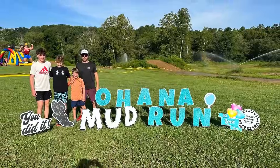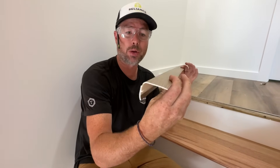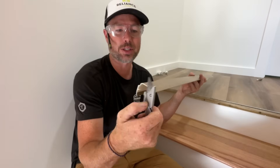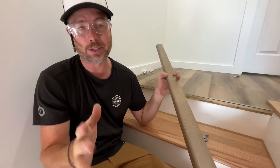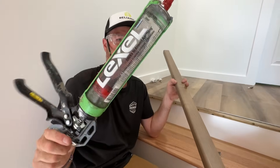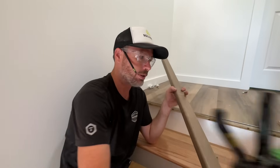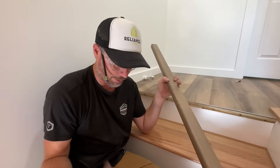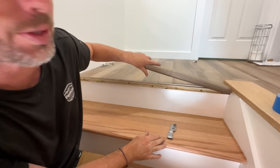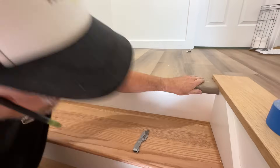The last step of the stairs, besides installing the railings, is this little piece of vinyl bull nose I've been cutting and whittling with a utility knife just to get this notch perfect around the trim board. I'm going to test fit it and if it's good, I'm just going to stick it down with some Lexel — not advertised as an adhesive, but once it cures it works great to stick stuff. A little blue tape, maybe a couple pin nails. We only have enough of this to do it once, so I hope I don't screw up.